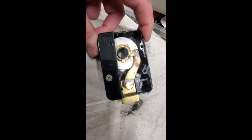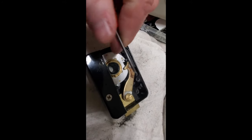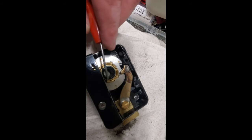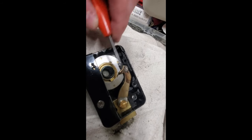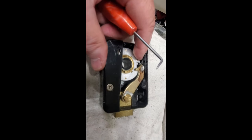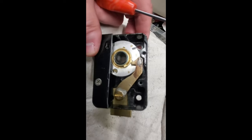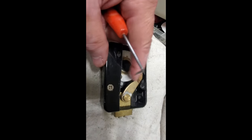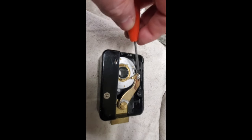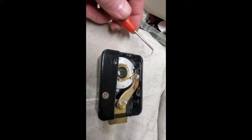Also, with the auto dialers, it spins these wheels around. We all know that, but these flies that are movable on here are actually pretty delicate little guys. So when you're dialing and smacking those back and forth repeatedly, I've never seen it, but I've heard about it, that yeah, they'll break right off. And then what happens is, no matter what you do, wheel 3 won't contact wheel 2, wheel 2 won't contact wheel 1, and you're basically locked out. Then you're going to be calling me anyways. So yeah, those are delicate little things. They're called flies. Those are used to basically time each one of the wheels so they contact each other. And if those are damaged, it won't transfer to the next wheel to dial. So you have another issue.